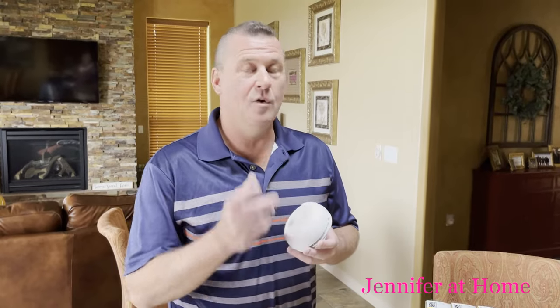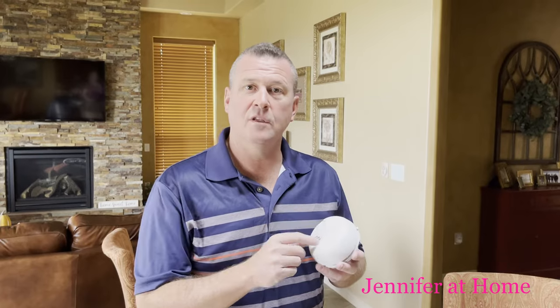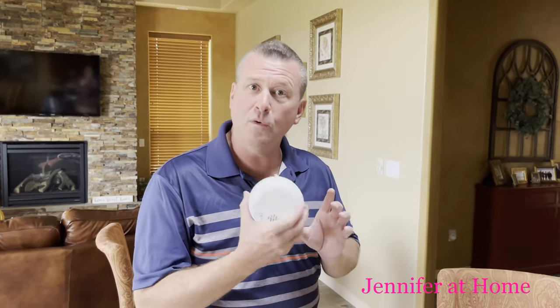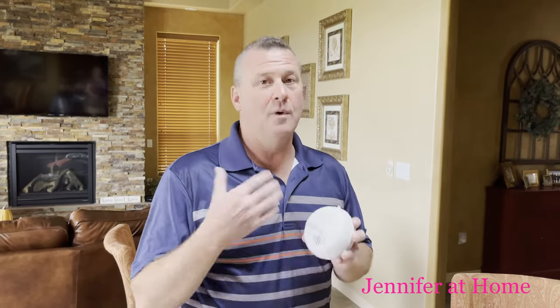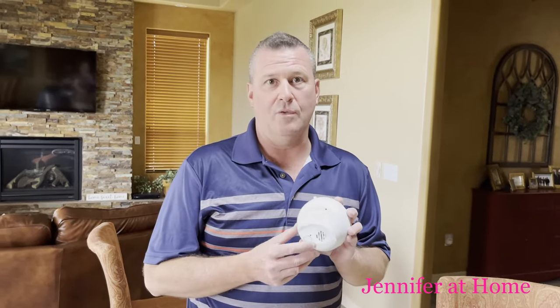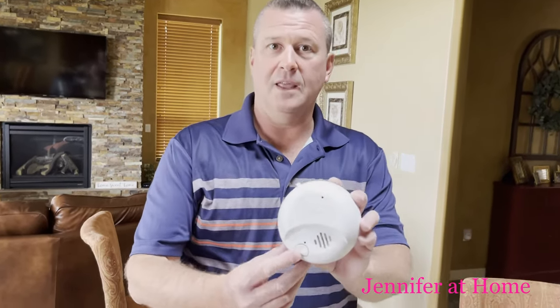Something I found out just a second ago: when we did the test and held the button on the combo detectors, it synced the two of them together. Normally it syncs all of them, but I noticed the green light was flashing on the new smoke detectors. So I went into one of the bedrooms, pushed and held the test button, and then it synced those three. So now all five are synced. I wanted to mention that in case anybody followed these instructions and wondered why all five didn't sync at the same time — you may have to do that as well. It's probably an electrical thing that varies by house, so always remember to push the test on at least one of them and let it get synced up.